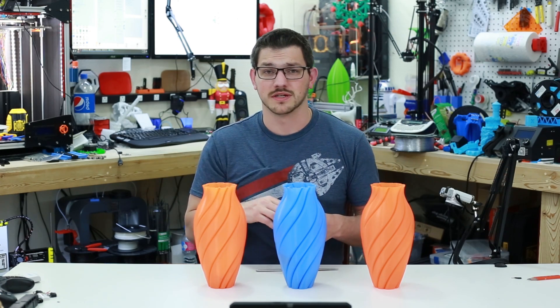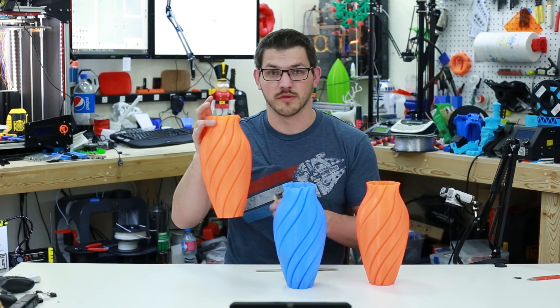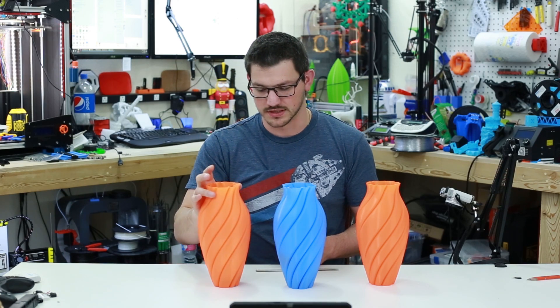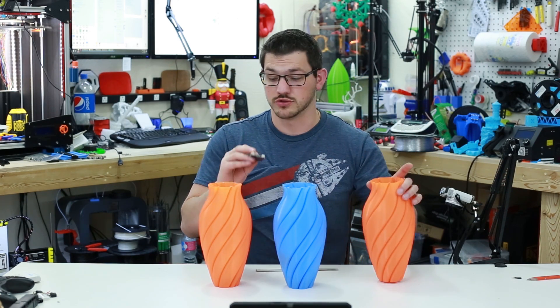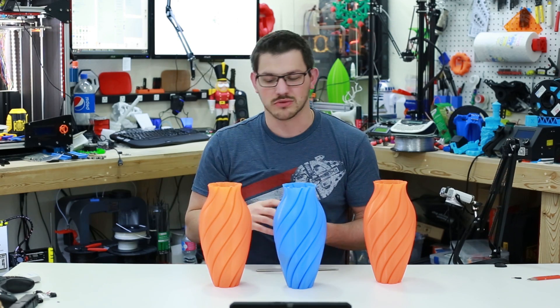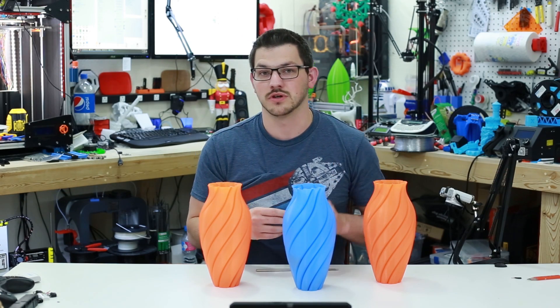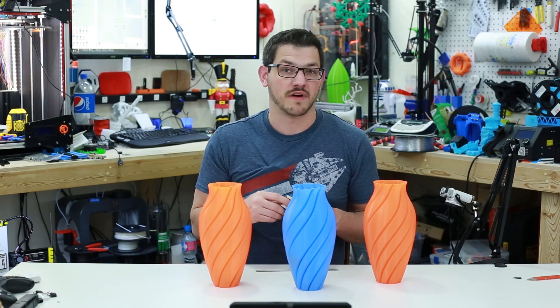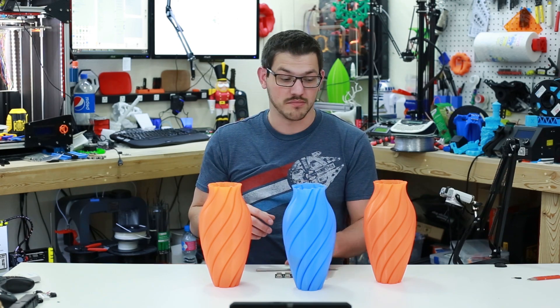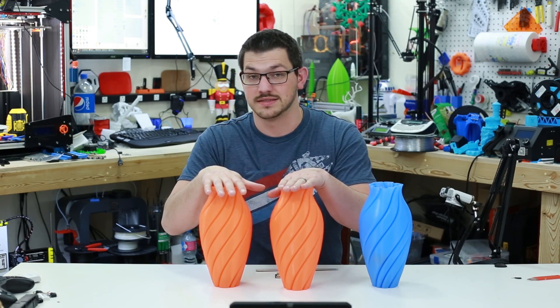I have three different ones here because I've used two different TL smoothers. Here we have the stock configuration — no smoother, straight from the board to the motors. Then here we have the four-diode module, which are the ones I got from Triangle Labs. This one only has four diodes, which means when it filters the power, it's only using four of them. That's okay but not great, because this other one is using eight diodes. Everyone says eight diodes are more superior. Let's take a look at what it looks like comparatively — let's check the stock versus the four-diode version.